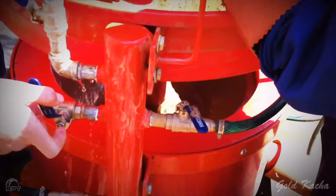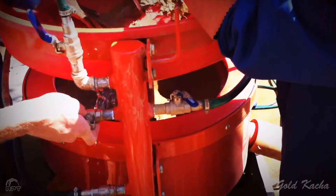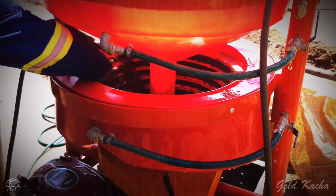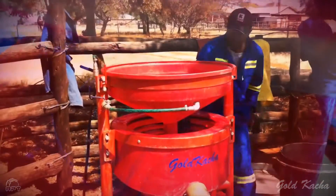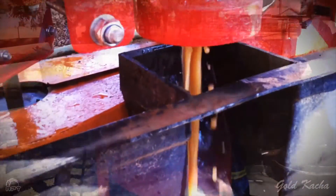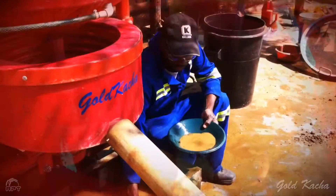After about an hour, the bowl should be loaded enough to perform the concentrate wash cycle. Stop feeding material, stop the motor, and turn all the water valves off. Using the wash water hose, dislodge all the concentrate from inside the Gold Catcher riffles and wash all the concentrate into the bottom of the bowl near the bowl plug. Next, reach into the bowl and pull the plug out — the concentrate should immediately start draining into the concentrate box below. Use the wash hose to clean the bowl thoroughly, making sure to leave no gold behind.